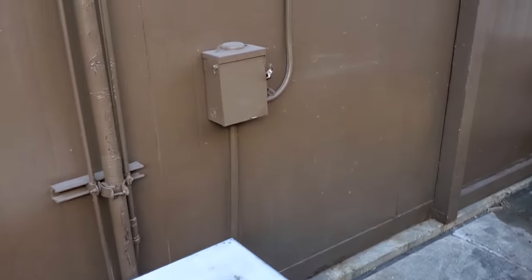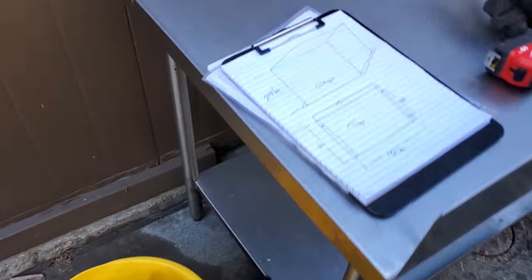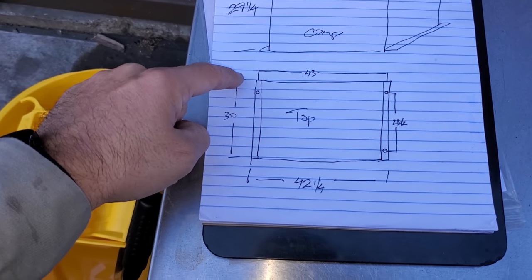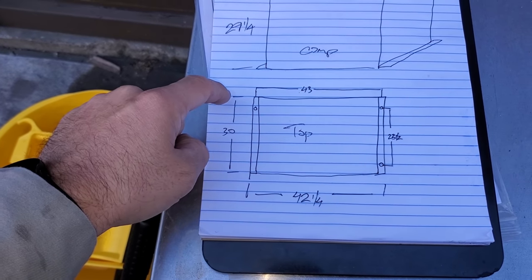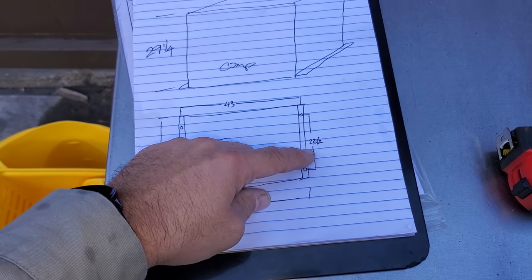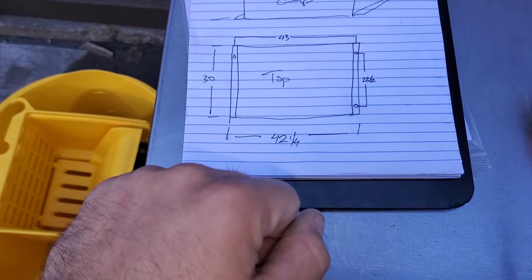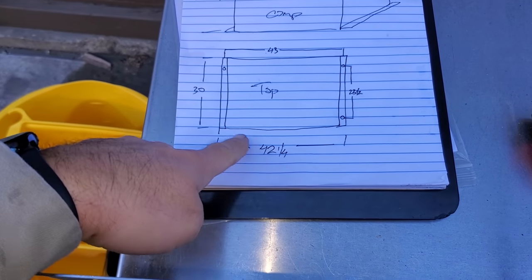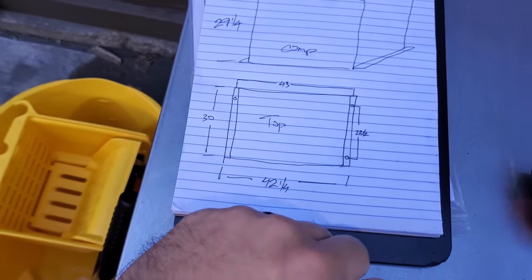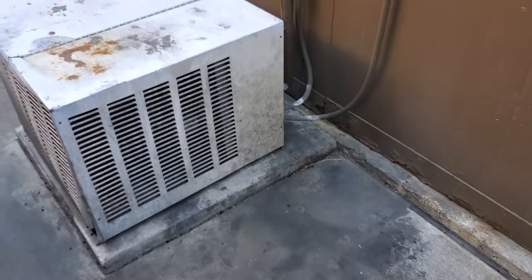We'll put a new disconnect switch. So I'm going to take some measurements. What I did was I drew out the condensing unit. I measured it right here — it's 29 and 1/4 inches tall. The whole total width and depth is 30 by 43. Then I have my bolt hole pattern. Center point is 23 and 1/2. And the center point of my bolt holes is 43. The actual unit itself is 42 and 1/4 — so that's the extra flange. So I think what I'm going to start doing is trying to build this stand today. I can probably build it right here.